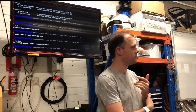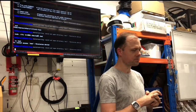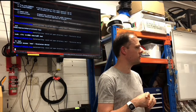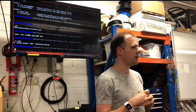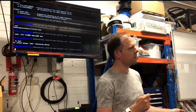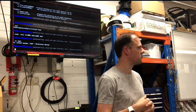You can use this program to mount your file system from your board on your PC and it just looks like a normal file system you can copy files across. You can also use RShell to copy things across over serial, or whatever program you normally use to copy things to an ESP, and it will work just fine. I would encourage you to switch over to use LFS — it's not the default yet, but after the next release comes out I'd like to switch it to be the default so you don't even have to think about it.